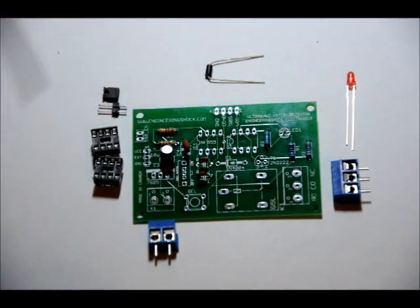Your power diode. Your power diode, very difficult to see from here, but on one side there's a white stripe and on the other side it's just black. The D1 slot, labeled D1-1N4004, has a white stripe on the left-hand side. Make sure that from a bird's eye view, the diode goes in with the white stripe facing the left and the black side facing the right.